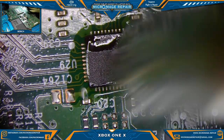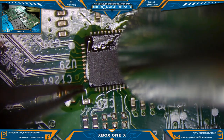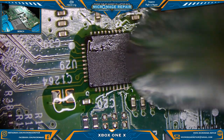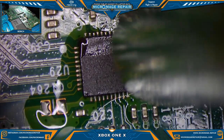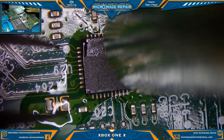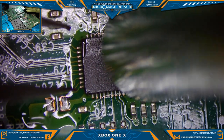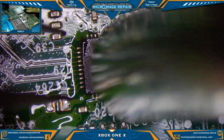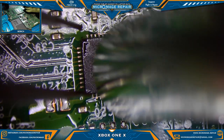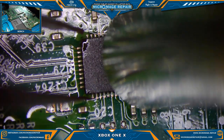Now we're going to focus in a little bit more on the chip. What I'm looking for is the pins to wet. You have to be patient — it dissipates a lot of heat. You generally don't have to worry about burning these boards. There are boards you have to worry about and boards you don't, and this is one of the ones you don't.